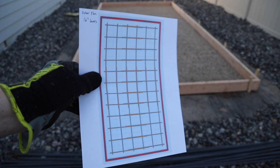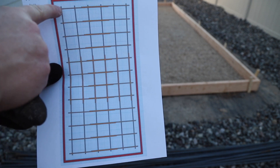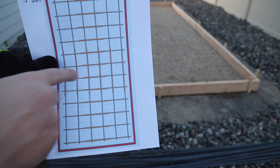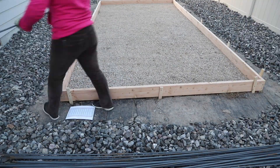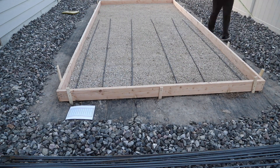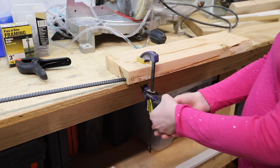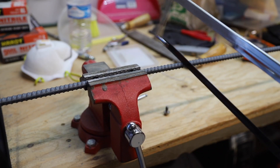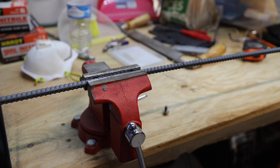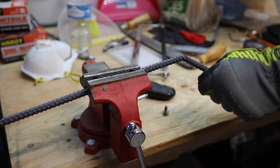Here's a printout of my grid that I used for reference while we were laying out the rebar. I explained to my wife the way it needed to be done and got her started laying out the long sections while I went and cut the 5-foot sections. Just like when you're cutting lumber, it makes sense to set up a stop block so that all of your pieces wind up being cut to the same length. At first I started cutting these with the hacksaw again, cutting about halfway through and then snapping off the piece.